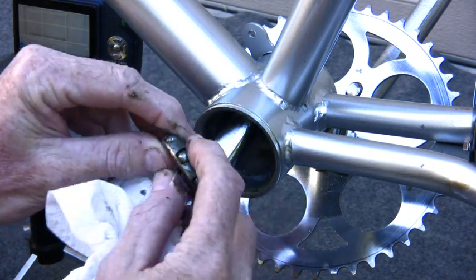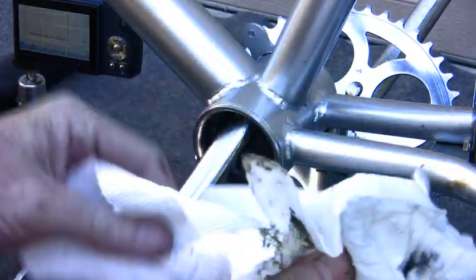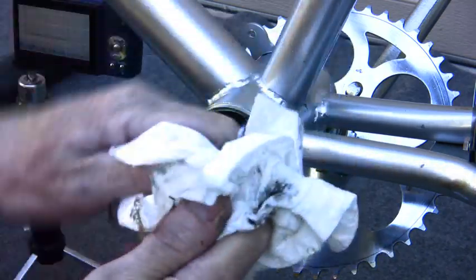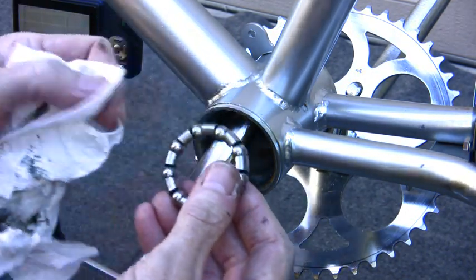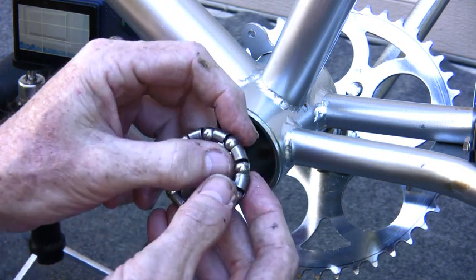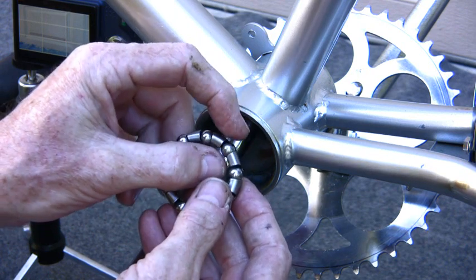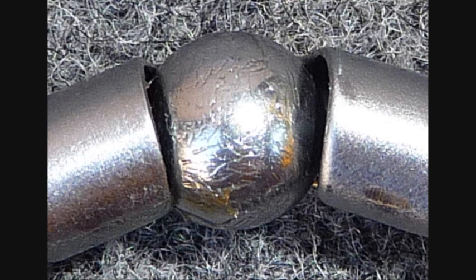You can see which way it faces. They call it caged because the loose balls are separated and running — this is just exactly the way they were making bearings a hundred years ago. We're going to microscopically clean these. First I'll use mechanics hand cleaner and hot soapy water, and then I will put them in the ultrasonic cleaner with some household ammonia. The balls look to be in not quite perfect condition — there's some pitting on them. So even after this is cleaned and adjusted, there will be some bearing noise. This is not first-quality bicycle manufacturing.